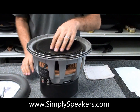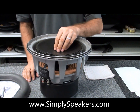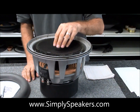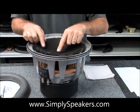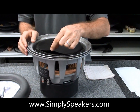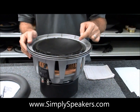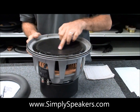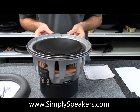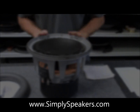A hairdryer works fine — just warm this polypropylene up a little bit. It'll soften the adhesive behind it. There's a little piece of sticky tape almost and a little bit of adhesive that attaches it right in the very center. There's no attachment point in the middle; this is just floating in here. The outside attachment point is already broken free because of the foam edge deterioration. When we come back, I'll show you how we heat this up and remove this properly, and we'll also work on the frame connection point.